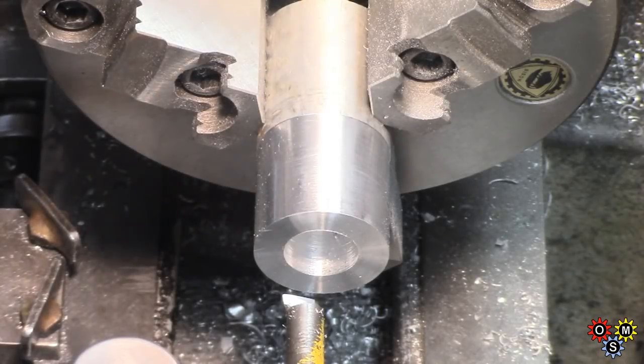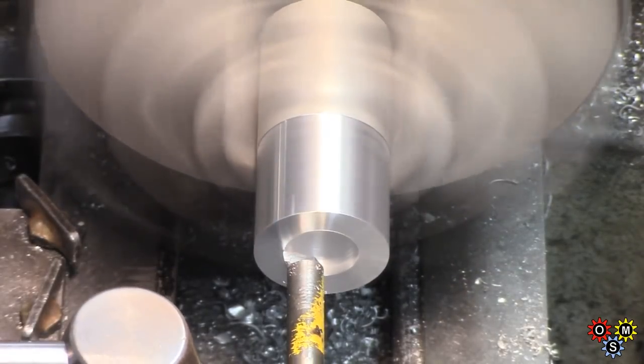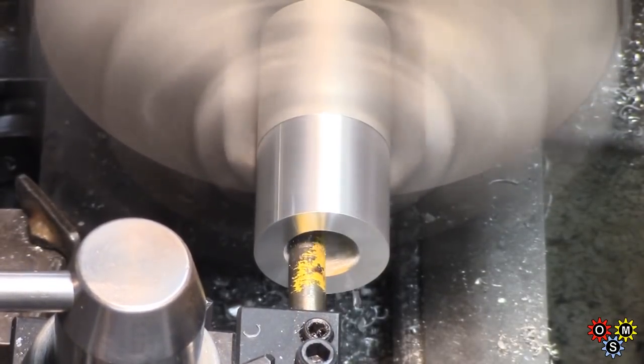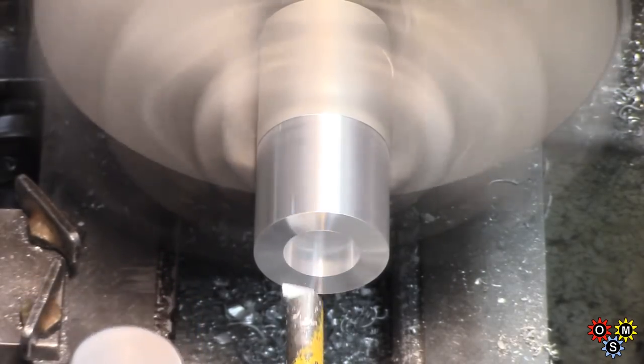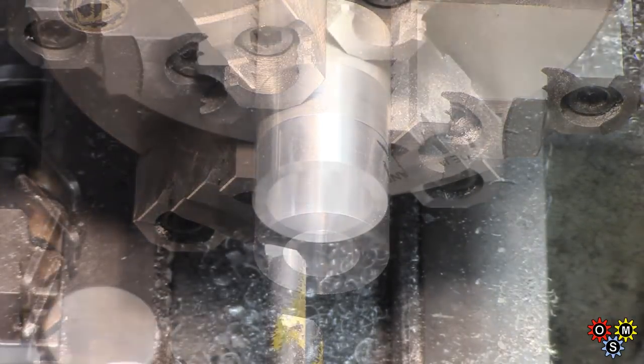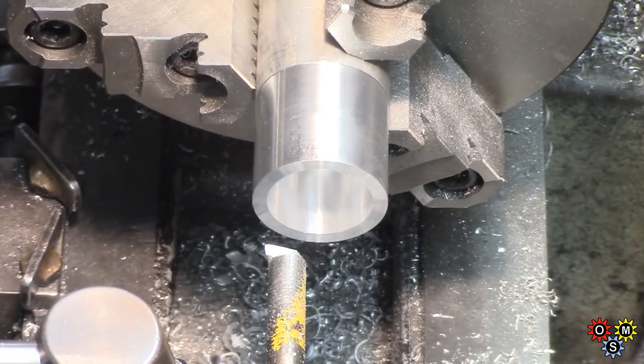Then we've got to think about boring it out. So it's more boring yet again. Drilled it out, of course, and now using the old favourite boring bar. Quite a bit of material to come out. Got a depth stop set this time so we don't go too far in. Keep plugging away at it. Like I said before, boring, boring. No need to see all of that.